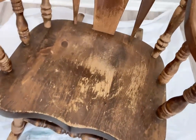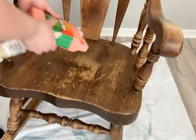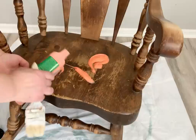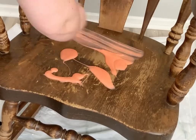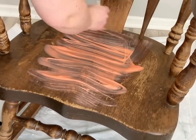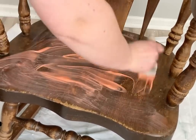I don't want to sand this, so I'm just going to use my citrus strip. You should always be wearing gloves when you use citrus strip, and it is safe to use indoors — it says so on the bottle. It's so cold and there's too much snow here so I can't really do it outside. I pour some on and then just rub it all over with my chip brush. Easy cleanup for the chip brush — just run it under water with some dishwashing soap.